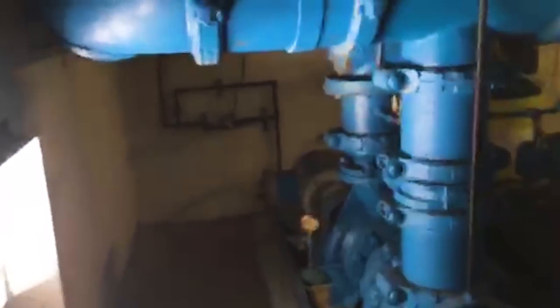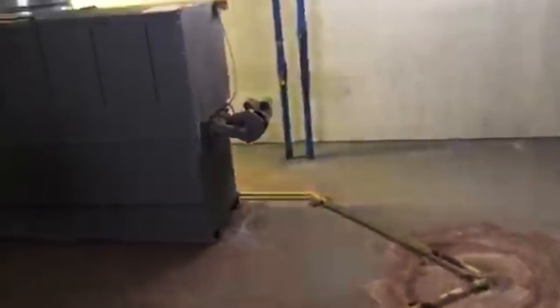A couple of pumps and strainers in there. If you look at our boiler piping, it's on the discharge side — you've got in and out closely spaced, coming off opposite sides, which is preferred, and then our discharge water. It's all running off the controller in here — a real simple Honeywell controller running all this, referencing the discharge water temperature. In heating mode it's modulating the fans. When the water temperature drops to a certain level it puts the tower in bypass, the fans will shut off, and if it drops lower the boiler will come on. The risers going down through the roof are copper and they've got circuit setters, shutoff valves, and air bleeds at all the risers.